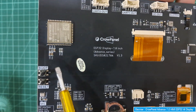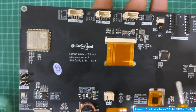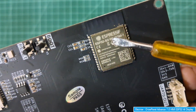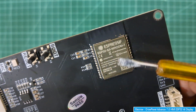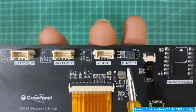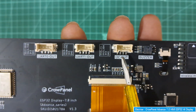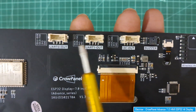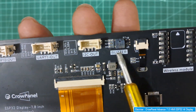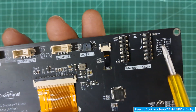There are two buttons: one for reset and one for bootloader mode. The main brain of this board is the ESP32-S3 microcontroller. There are also UART ports, an I2C port for connecting various sensors - they have over 150 compatible sensors. Additionally, there is a built-in buzzer for notification purposes.